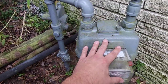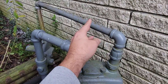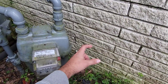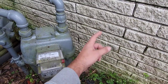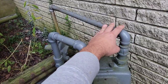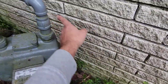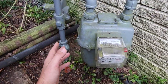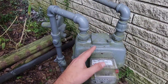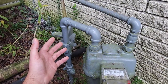This is the outside meter and this is the gas line that goes into the house — this is three-quarter. Normally it's one inch and you have an L, drop down with your L, and you have a drip leg. From your drip leg with your T, you can go out to whatever you have inside your home. So you should have 40 pounds coming in, drop down to around 7 to 8 inches of water column, and then at our gas valve we should have around 7 inches. Let's go take a look at the furnace.